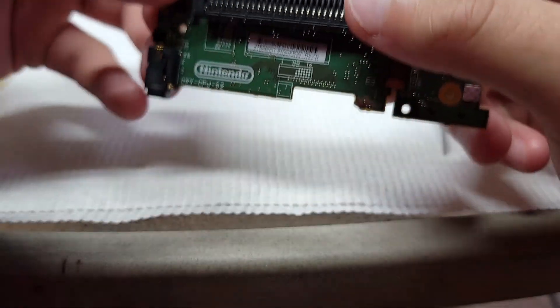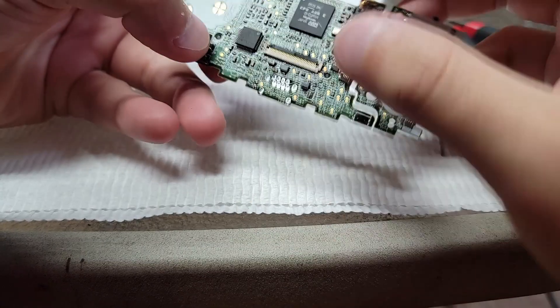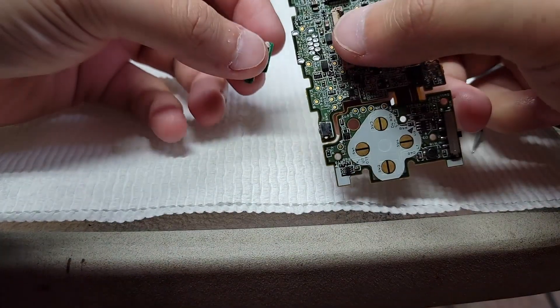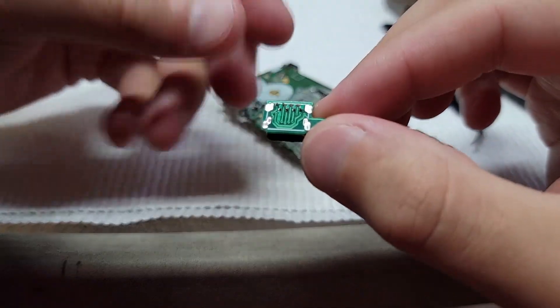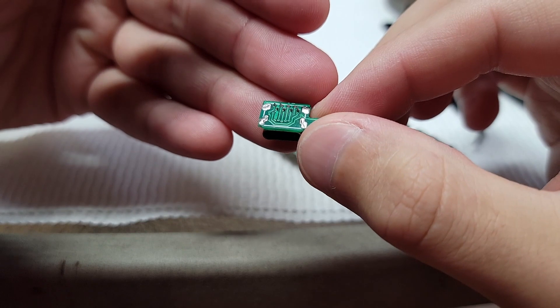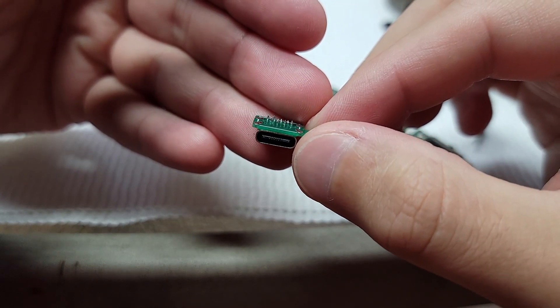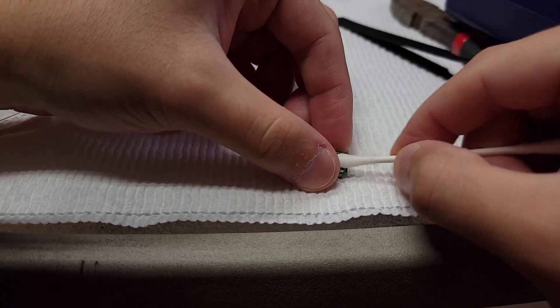Right now I'm just inspecting the port. You want to make sure that everything is clean and all the solder is off the pads. You want a smooth surface to attach this adapter. When you get the adapter, you want to make sure you see those spikes sticking up, and you also want to make sure that the solder on the pads are as flat as they can be, because you're going to be pushing this up against the micro.